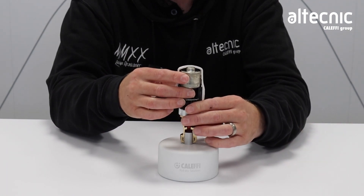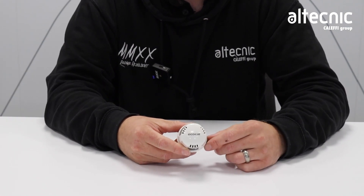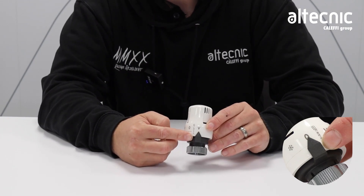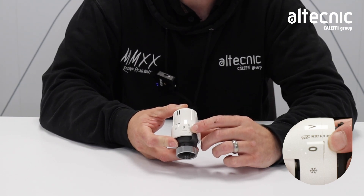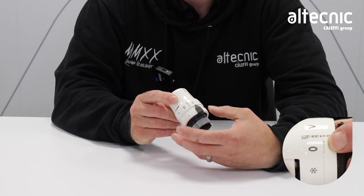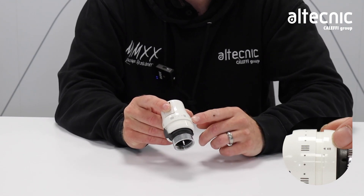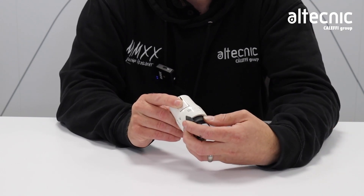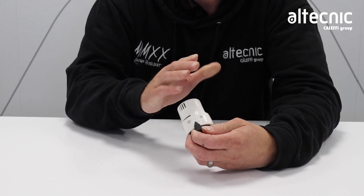We're going to have a quick look now at how the anti-tamper function works on the valve head. One neat feature of the EcoCal radiator head is its ability to lock the function. You'll note there's a pointer ring and just before the zero, there's a little reset arrow. When pulled down, this reset arrow can be rotated round to a set point. For example, I would like my radiator to only be accessed between 3 and 5. I can then lock it up and my radiator valve will only actuate between 3 and 5 on the dials, which records a set temperature.